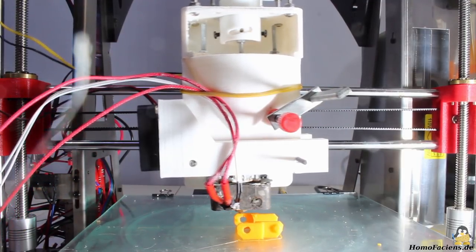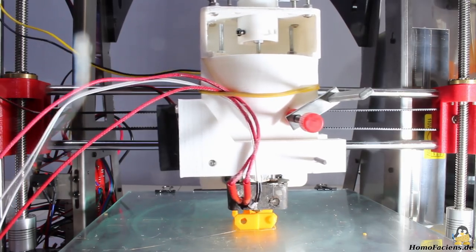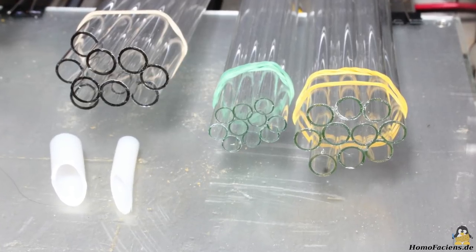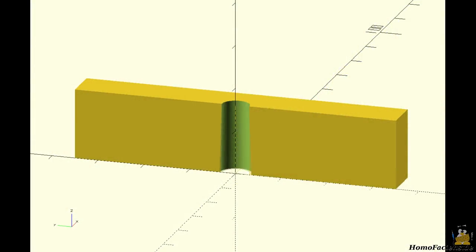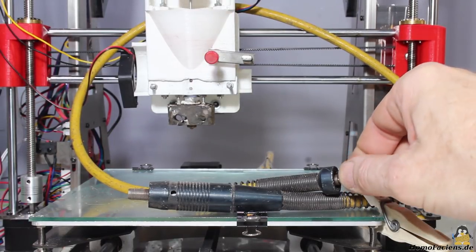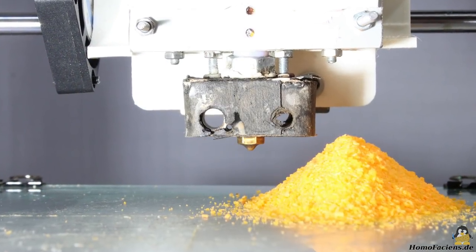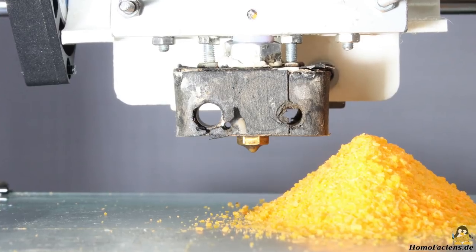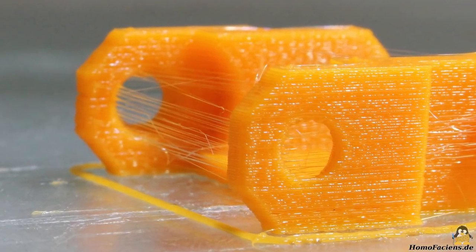This is the current stage of my development — not bad for a start. I have ordered glass tubes to check if they are suitable as a replacement for the Teflon tubes. To completely eliminate such exotic materials I'm experimenting with a slightly conical bore with a larger opening pointing towards the hotend, as well as further changes in the geometry of my extruder. With a flexible shaft, the width of the moving parts of the print head can be reduced and the stepper motor can be attached to the printer frame as with conventional Bowden extruders. Waste plastic is never free of contaminants, so a filter in the hotend prevents clogging of the nozzle. The direct granule extruder is quite sensitive to stringing and here I am investigating two ideas.